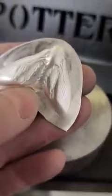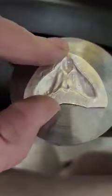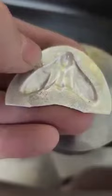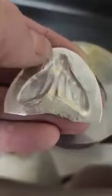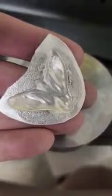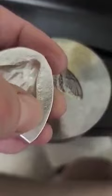I continued to use paper and urethane to press a few more times. I still don't have all the detail in the head, but I'm going to anneal again. You can see I've started to pick up a whole lot more texture than before. Along these edges I'm pretty sure I over-pressed, so this is where it's most likely to split — I might have pressed it too much too soon. But next I'm just going to anneal and continue the process to force the metal down into the die, trying not to trap any of the metal on the outside against the surface of the die.